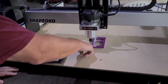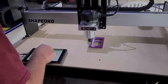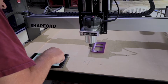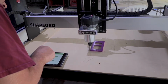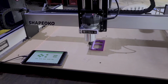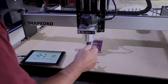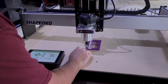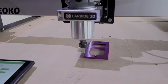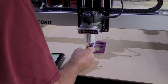When you're setting your job coordinates, your XY point, you need to bring the tip down all the way. Well, maybe that's too slow. All the way down, and I almost touch it. And you kind of have to look from both angles to see, but your goal is you want it right on the very edge.